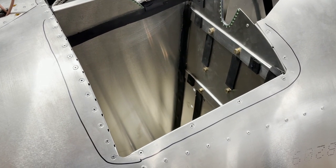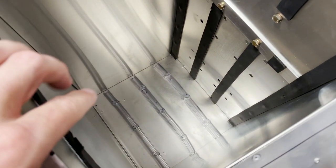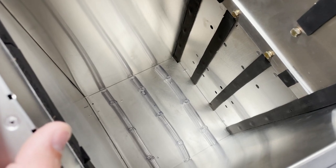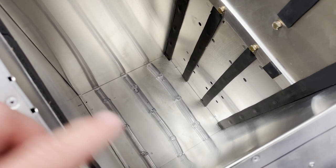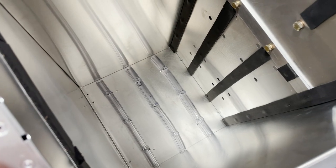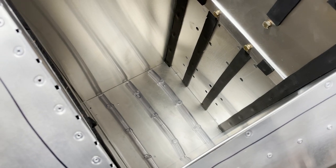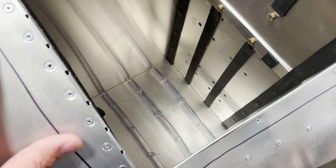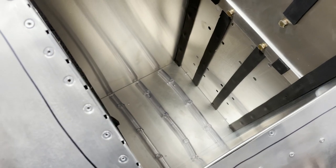To install your parachute there are a couple of first steps to take care of. You're going to want to cut your PVC clear tubing into 300 millimeter long sections, then cut out small circles on the top and pre-drill where you're going to rivet it down in the parachute compartment. This clear tubing acts as a pad for your parachute to make sure it's not rattling around very much, but more importantly in the unlikely event that some water gets into your parachute compartment, the parachute itself is not soaking in that water.